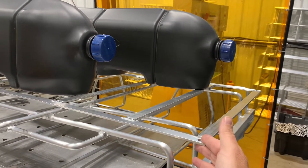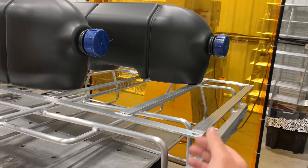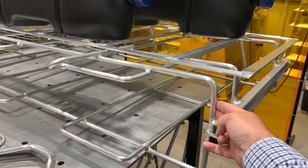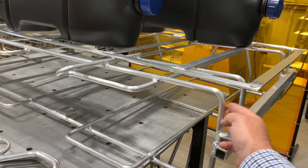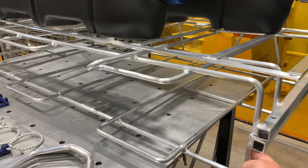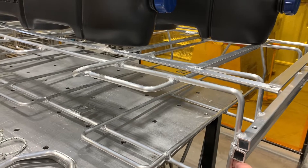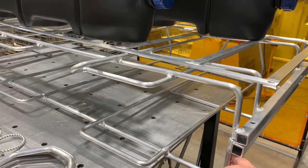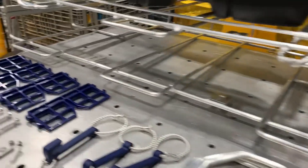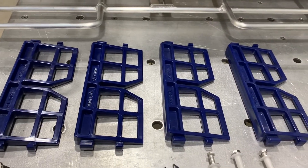The next major component is the shelf. The shelf divides the bag and is part of the integral structure of the cage itself. The cage is basically like a clamshell — a shelf put in two halves, a top and a bottom. The top is where the floats attach. The bottom is the underside and has three different bends in different directions that retain the bags as well.